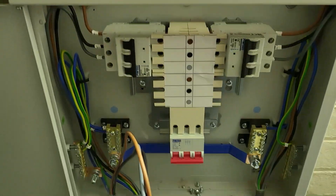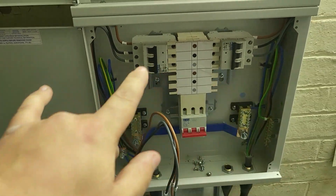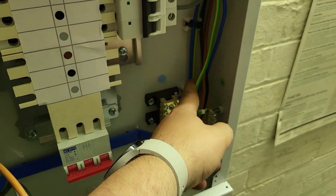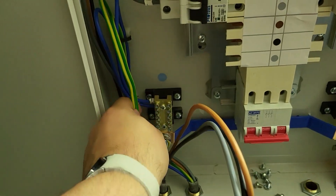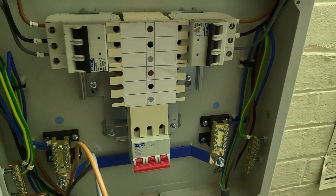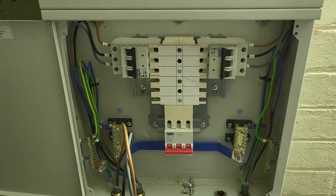This is a project I've been designing, so it's not on the guys — I put the wrong material schedule up and left the order too late. Nathan has wired all of this up — this is a kid who's seven to eight months into his time and he's got it all labeled up with ID idents on the cables. We've used a couple of little holders in the back for the neutrals and earths, while the L1, L2, L3s are loose so you can take them out easily for testing. There's plenty of length on them — looped in the back and a long loop on the front to get into the terminals so anyone coming along to test this afterwards can identify everything and has plenty of cable to work with.